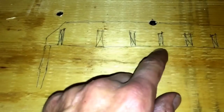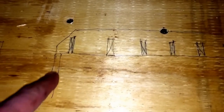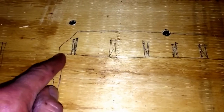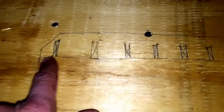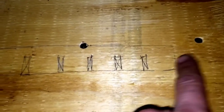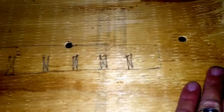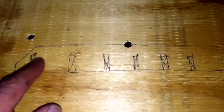The kind we're going to build for this project is a hidden beam. This hidden beam does not ride above the ceiling joists — rather, the ceiling joists ride on it. The exterior wall will have a number of 2x4s together underneath the top plate. The beam will be cut to match our roof line and extend over onto another load-bearing wall, so the load of these ceiling joists is transferred. We'll use joist hangers to support the ceiling joists against the beam.